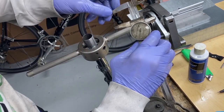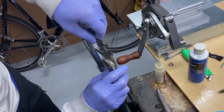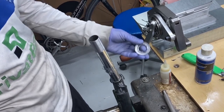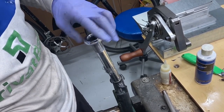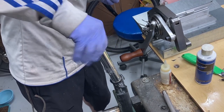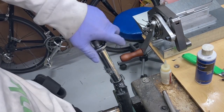This is the final chase of the threads. 40 millimeter threads are cut and I'm testing it with the headset. It has to screw on smoothly without any resistance and without much play — almost without any play — for the best results.